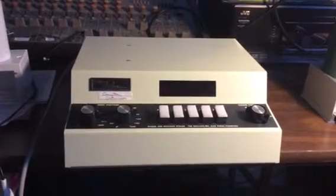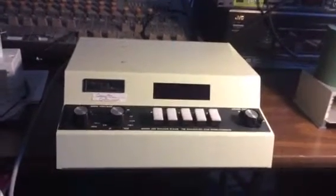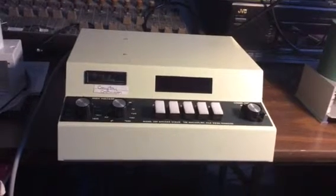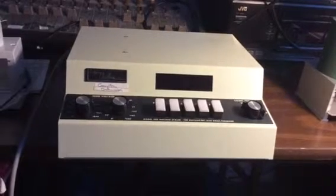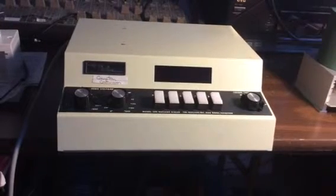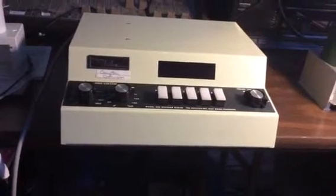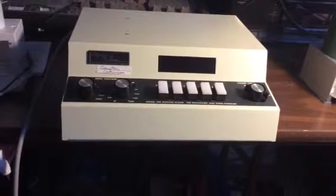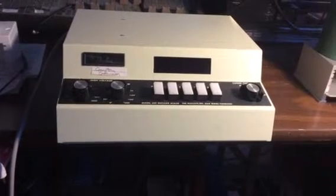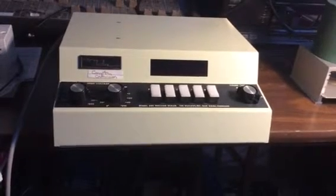This video will show everyone how to turn a nice vintage Nucleus 500 scaler, probably made back in the 1980s, into — or at least add — a sound card multi-channel analyzer output. This uses the Nucleus scaler's high voltage power supply and one stage of its preamp to replace those three to five hundred dollar boxes you're seeing on eBay these days for home gamma spectroscopy use. This whole conversion will cost about two dollars and it's extremely simple to accomplish.